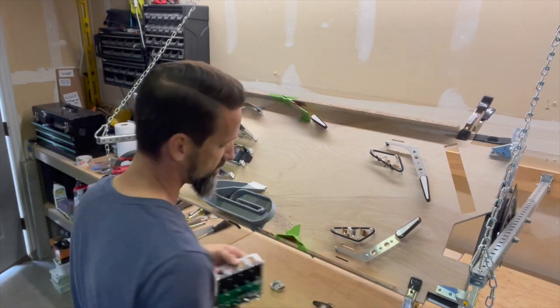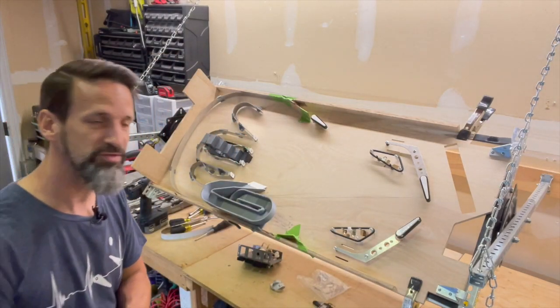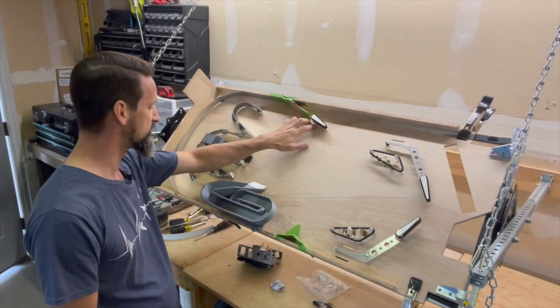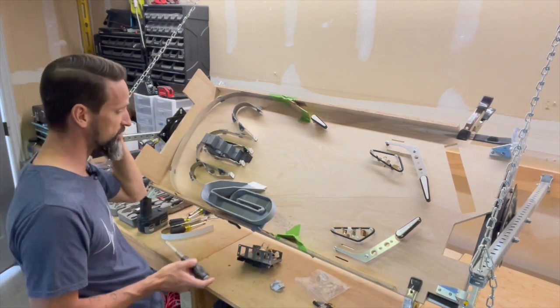I've also got the 4-bank drop target and some stand-ups, and we're going to go through and put those in. So I think we'll take off this flipper. I'm going to slide it down about another 1/2 inch, another post width pretty much. And then let me show you where we end up on here and how we got that shot working through here. I think it's working pretty good.